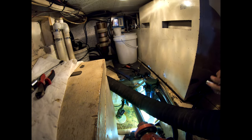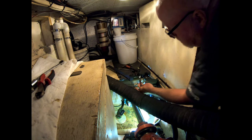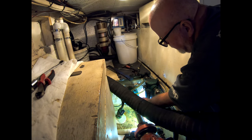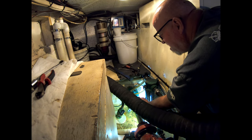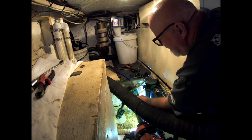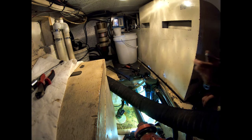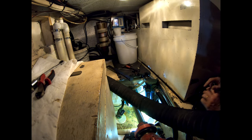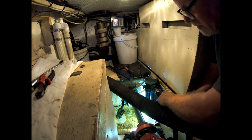I'm giving each bolt about another quarter turn — that's about it. Like I said, you don't want to over-tighten these. I'll put my back nut on there and that should be good. I'll have to check this again, but right now it's not leaking. When it was running it was leaking slightly — that's what it's supposed to do. I think I'm in pretty good shape. I've cleaned my AC strainer for the air conditioner.